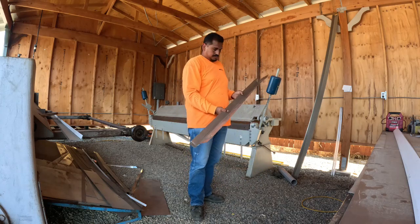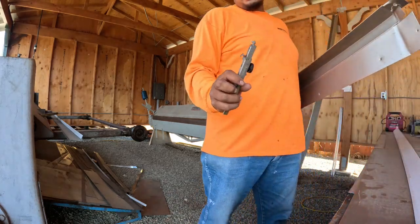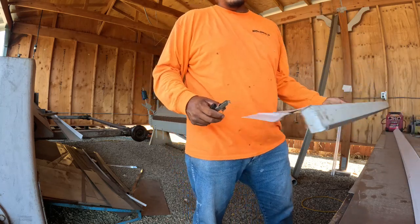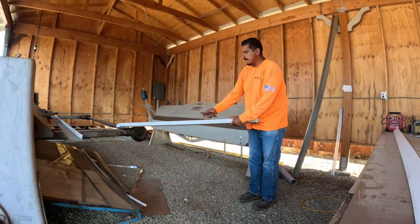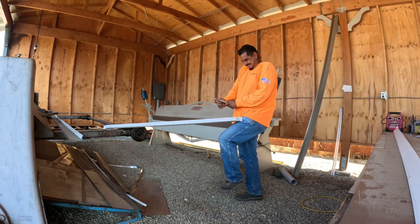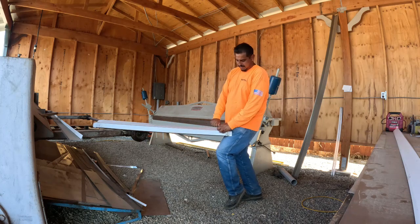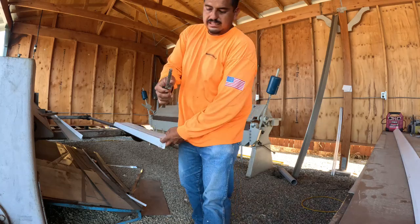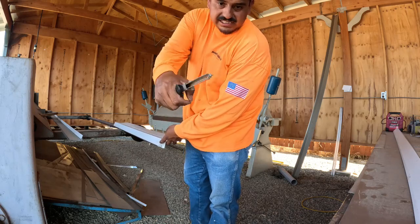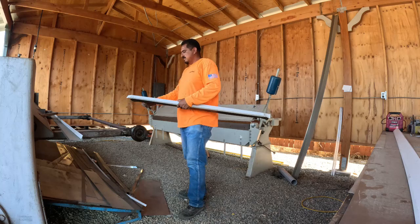All I'm gonna do is measure that 1.5 inches here. For sheet metal, we use this guy here. It has some measurements there. You can adjust it to whatever you need. So I'm just gonna mimic that one side, loosen it up. See here? Loosen this guy. See, the adjustment goes in and out. So we get that measurement that we have on that side that we want to go with. And then the material gets stuck here, and there's just a self tapper. This little pointy thing is just a hex set self tapper. Nothing crazy. And that's how we score it. That way we can get that desired length.